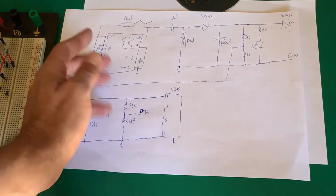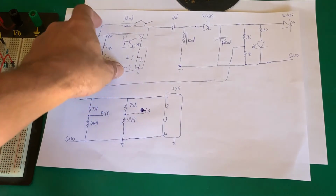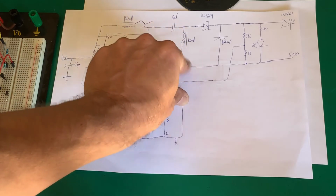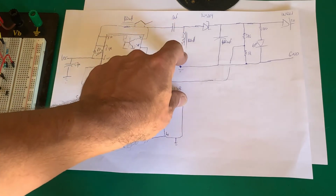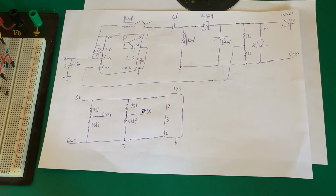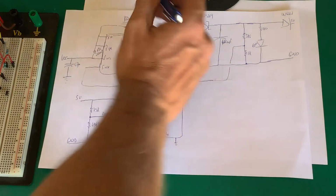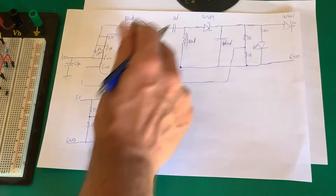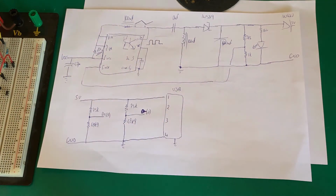Because if you look at it, how is that voltage getting there? It's that capacitor that's coupling it. It's letting the AC component flow through to charge, and that's what's happening here, and that's the magic of the circuit. You have to understand the DC side is blocked, it's the AC side, and because we've created a pulse over here, doing that is AC. Okay, and that is what our capacitor is letting through.